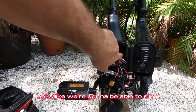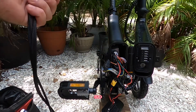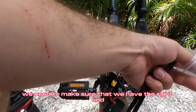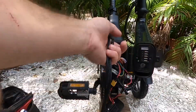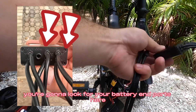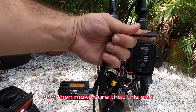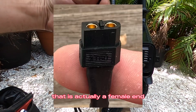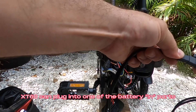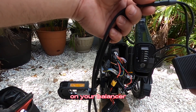Looks like we're going to be able to slip it right up in the side here, so shouldn't have much of an issue. We're going to run the cables up through the frame from the back side. We need to make sure that we have the right end come into the housing — look for your battery end ports here, and then make sure that this end, which is actually a female end but looks like a male end for the plastic XT60, can plug into one of the battery end ports on your balancer.